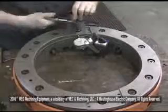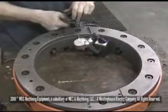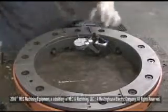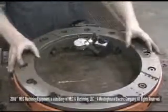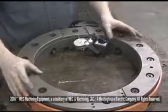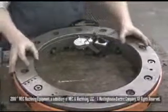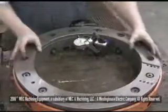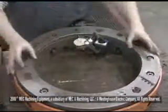Break it loose, and make sure you've got your bearing touching properly there. Make sure your bearing is touching in your V-groove. Go back, check it again. You want to look to get within 5 if possible here. From there, you go 180 degrees directly across, whether you're starting on the sides or your 45s, and you always want to adjust directly across.